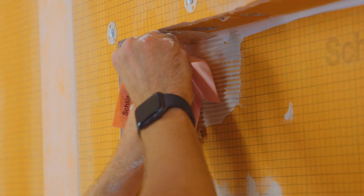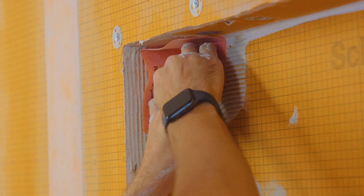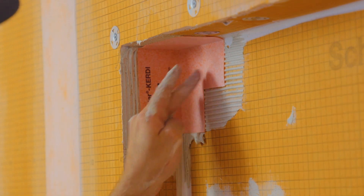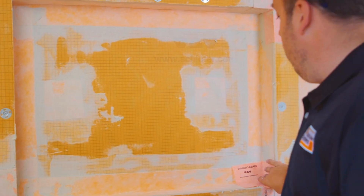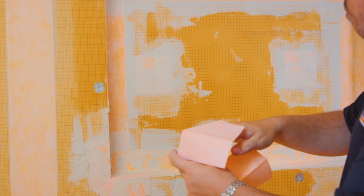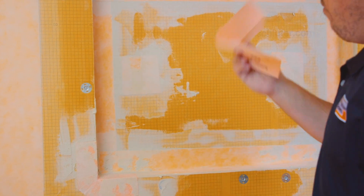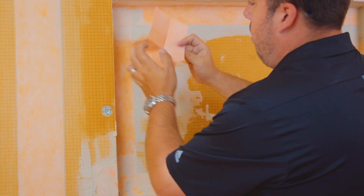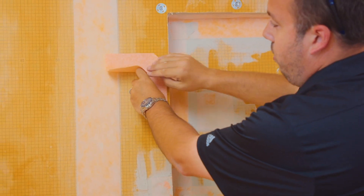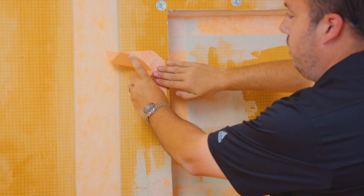When working with the inside-outside corners, you'll notice that they do have the writing on the inside — it's not important to have that writing visible on the outside. This works for an inside corner, but if you had a bench, this can also work as an end cap to waterproof the end of the board or end of the bench. For inside corners or outside corners, you can see that if you were trying to wrap over top of a curb, this would go over top of the curb, tying the wall into the other substrates.